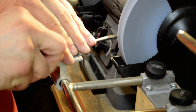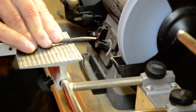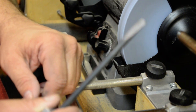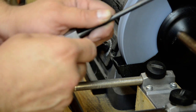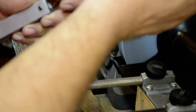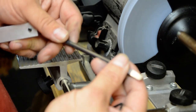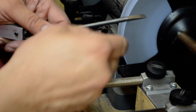Breaking those corners off. Don't try to round it completely on here because if you go in like that it's going to grab and throw it out of your hands into the wall or your head. I don't remember what size set screws I put in here — they look like 8-32s, that's all you need. I've got my fingernail profile done — I need to clean it up. That's a good sharp point for getting into tight detail. The bowl profile is more for smoothing out larger radius rounds.